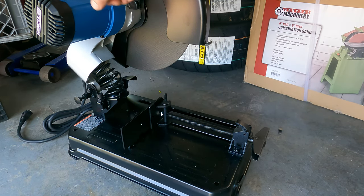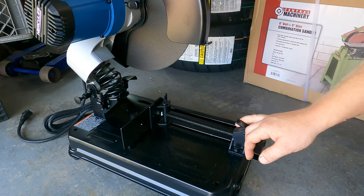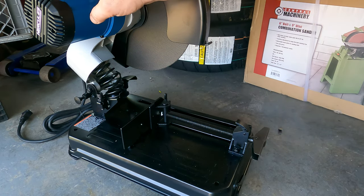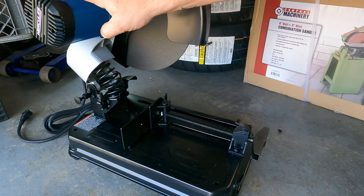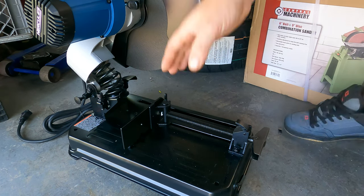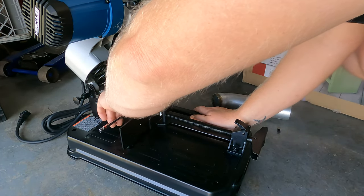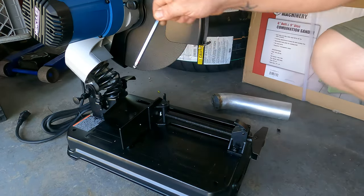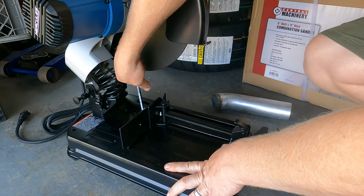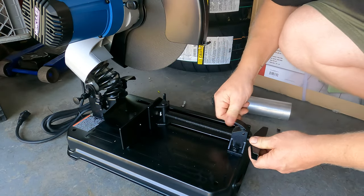These caps here are so you can replace the brushes inside. Obviously it's going to be full of dust and grinding, so replacement parts are something you'll want to keep in mind. I wonder how expensive replacement parts are right now — maybe just keep some on stock. I need to get an Allen wrench for this. They didn't crank them down hard, and they're flanged too — that's cool. The flanged nuts are going to provide extra clamping force without having to super twist on them.